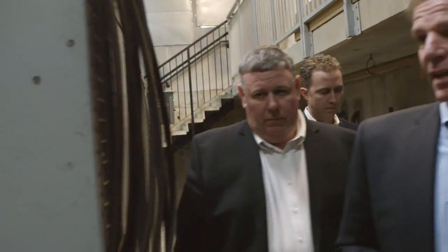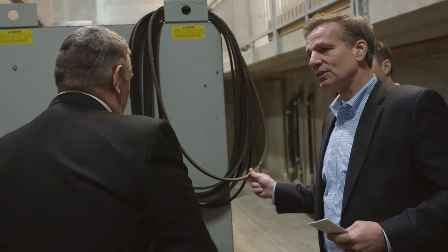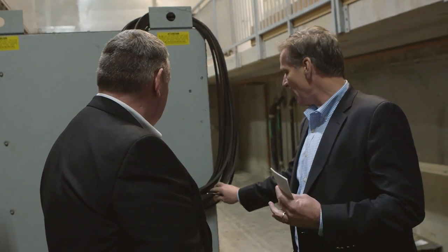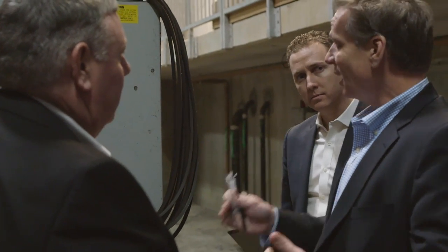We should go over here and check out the power bands and the belts. These have those big ginormous motors and they've got some belts back here. These are the power bands — they've got a lot of spares just like we do. It's because they're constantly breaking, and if you're not putting in that proper maintenance and tension, and they're hard to get to inside, that'll waste a lot of energy.